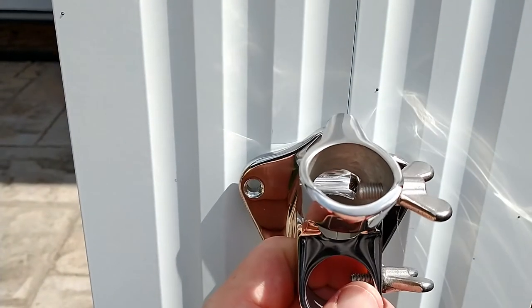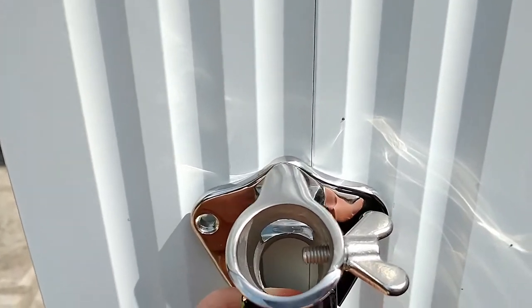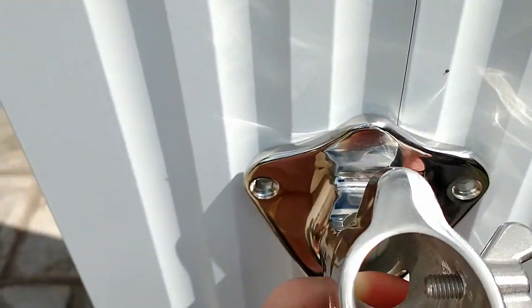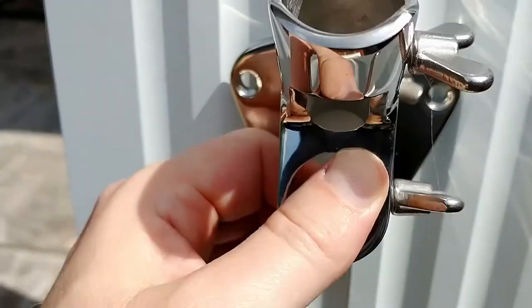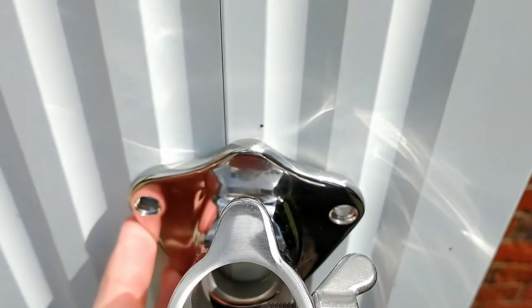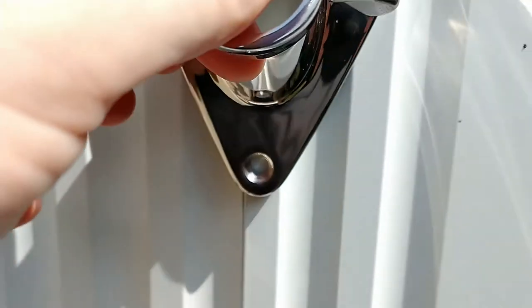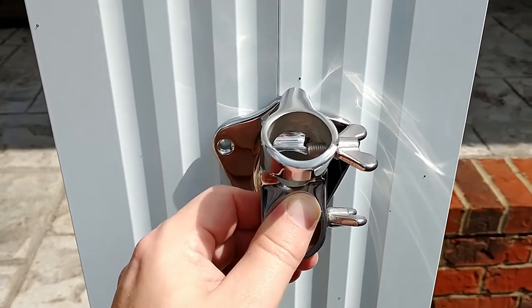Okay, so if I took this thing and I centered it, it would actually look something like this. That's centered left to right exactly, which is where you would think you'd want to do it. That actually brings the screw holes into those radiused fluted areas, which is just kind of not good. So to get it to come in on the flat areas, I'll move it over just a little bit like that, so that our screw holes will go into the flats in between the radiused flutes on this column. It'll be slightly off to one side, but I don't think it'll be a big deal.